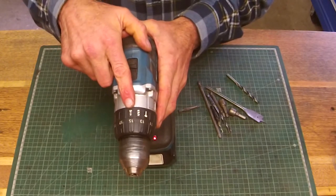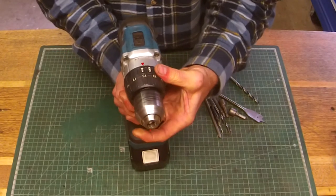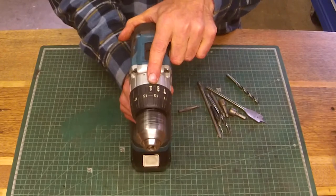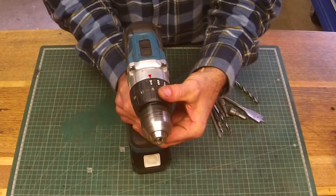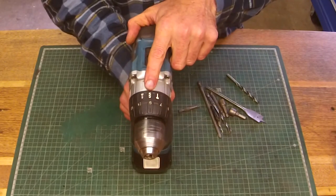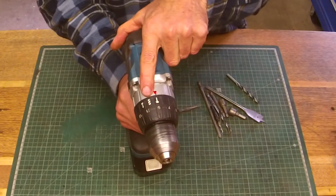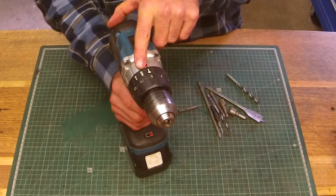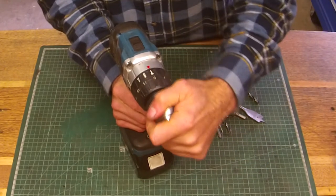It has three functions. The driver function is for putting in screws. The drill bit function is for normal drilling. And it has a hammer function as well. You just twist them to put it into whatever setting you need. When it's in the driver setting - the little screw icon - that's when the clutch comes into play, so you can set the clutch at whatever torque setting you need depending on what you're up to. When you're in the drill setting, the clutch settings don't count anymore - it's just like a normal cordless drill. And when you're in the hammer function, it's similar to drill mode, but the hammer function is only used for brickwork or masonry when you've really got to smash through something. The key difference is the chuck, as well as spinning, also rotates in and out so you can smash through the brickwork.